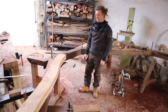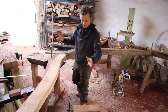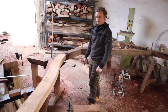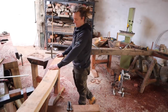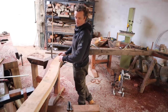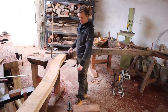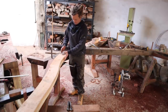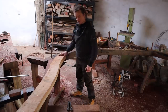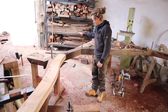Good morning everyone. Yesterday I showed an example of how to make a very simple basic wind brace when you're starting with something square — put 45s on it, make the shoulders, then cut the 90s relative to the tenons. That's a very good viable way and I use it often. But sometimes you have to start with a very curvy piece of wood like this that I cut out yesterday, because it wasn't milled square — it was just slab cut. So there's literally no square reference point on it anywhere.